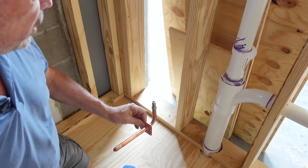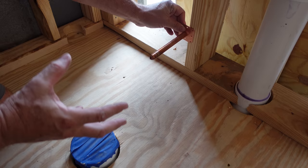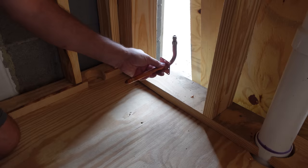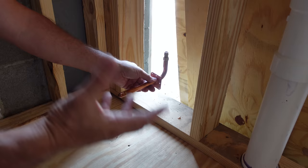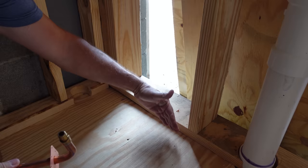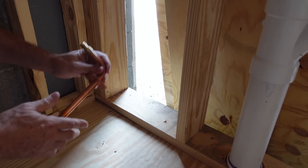Back in our bathroom, let's check out the toilet stub out. We're going to use this one with the cool mounting flange. I could put it on the stud but it'll end up right behind the bowl, which is very inconvenient. If I put it over to the left I need a super long hose. So typically I like to come eight inches off center, about six inches above the floor. In a residential project I always account for the height of the baseboard. For this wall, tile goes all the way down so we can put it anywhere — a simple block across, drill a hole, stick it in from the back, secure with screws, and it's very strong.